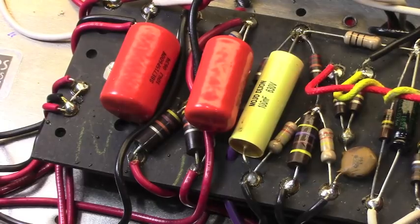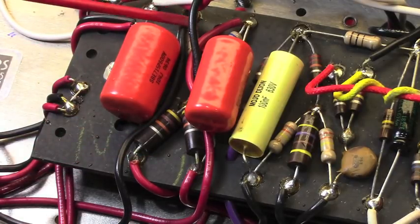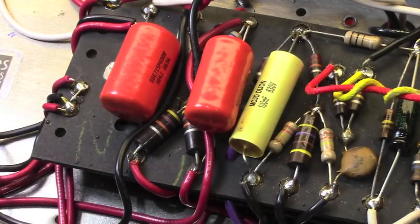That seeks to tighten the amp up a little bit. The player, the owner of the amp, has a certain playing style that sort of choice will lend itself to. And also I did something different with the 220Ks up here. Those are 68Ks, which is again something more of a later silver face thing.